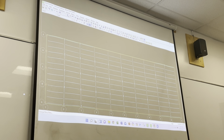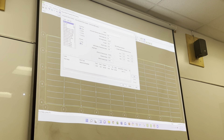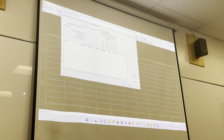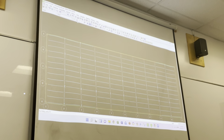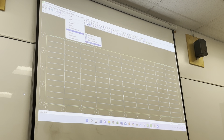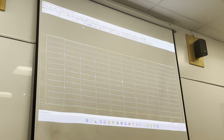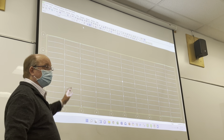We need a deck on here. We'll go back to our decking. This time we want a non-composite deck. We're going to click on non-composite and call it a roof deck. We're not worried about self-weight, and we don't need the other stuff - we're not going to use it for the diaphragm. We'll just add it and hit OK. Then we'll go Layout, Slab, Deck Assigned, and go the short direction - up and down - one-way deck. We want non-composite - there's our roof deck we just identified - and we'll put it on the whole floor. You can see the purple lines going up and down, indicating the deck direction.